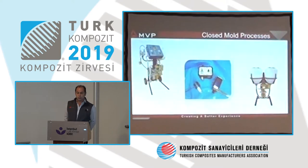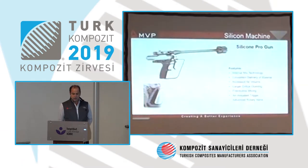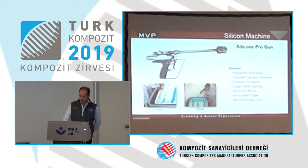We can do that with a normal plastic bag or with a silicone membrane. When we want to produce by infusion, we need an injection machine, accessories including injection head, pressure sensor, control box, and then a silicone machine if we want to build a silicone membrane. Silicone is easy because it's one-to-one — nothing complicated — and with the same machine you can pour or spray the silicone.